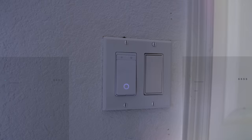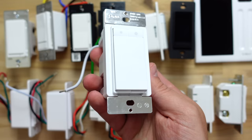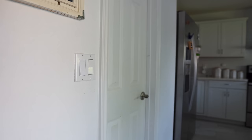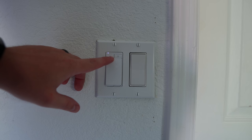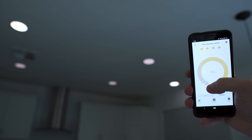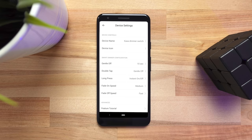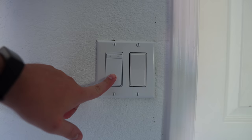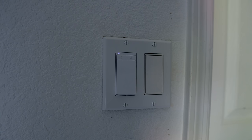The next ones are from Kasa, which are very popular. I've been using the on-off switch for my front porch light for a while and it's worked great. The dimmer switch seems much higher quality than Treat Life or Gosund out of the box, especially having more metal on the switch. The dimmer buttons are up top and it's a little more intuitive, making the on-off switch easy to hit without accidentally pressing the dimming buttons, though you cannot change the brightness as quickly. You can set the minimum brightness to one percent — there was a little bit of flickering at that level, so you can move up the minimum brightness to fix it. Where the Kasa dimmer really stands out is the extra settings: lights can slowly fade on or off and you can adjust it, and you can set what a double or long press will do. For example, a double press could slowly turn off the lights as you walk away, or a long press could go to 100% brightness. Out of the inexpensive Wi-Fi dimmer switches, I like the Kasa one the best. It's compatible with SmartThings and feels really high quality for the low price.